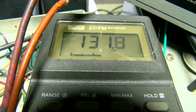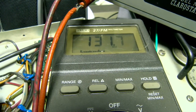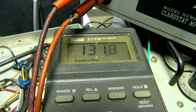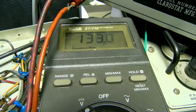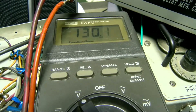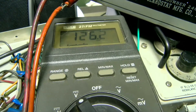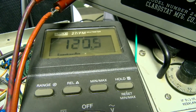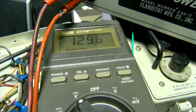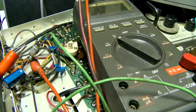It wants to be about 67 ohms — it jumps around a little, which might be line voltage variation. You want to make sure you don't have any variac or isolation transformers; set it up like you're going to use it every day. I'd rather run it a little low, so I'm going to go with 80 to 90 ohms. It's not that critical — every situation is going to be different. Don't assume that 70 ohms will work for you just because it worked for me.